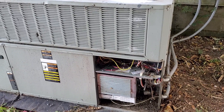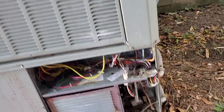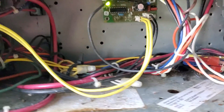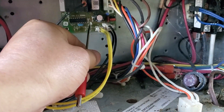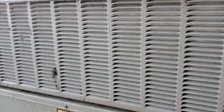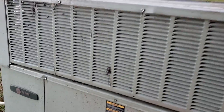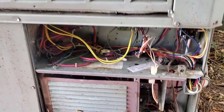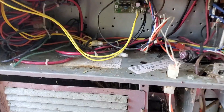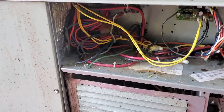That should last about one minute. Let me see what I can do here — shorten these pins, loosen these two here. There we go — you hear it? The reversing valve kicked in. Fan turned off. Hear that whining? Compressor's still running. Hear the blower running. Emergency heat should be on. Never had a problem out of emergency heat.